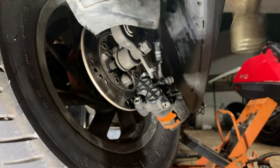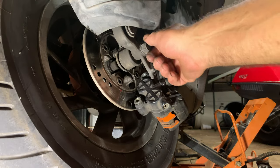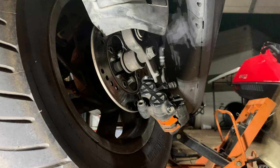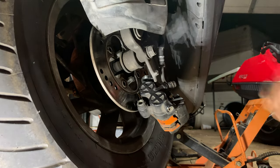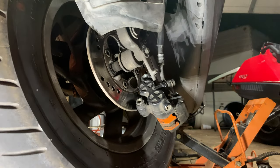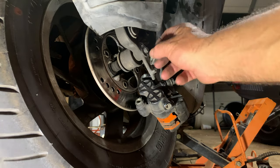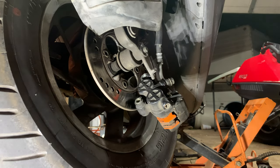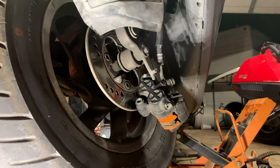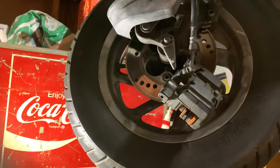Get your hammer — see it move? Unscrew it a little bit, tap it again, unscrew it a little bit, tap it again. The reason we put the nut on here and tapped on it with a hammer is so that we didn't mess the threads up. You don't want to mess that bolt up — I don't even know where you'd get a new one.